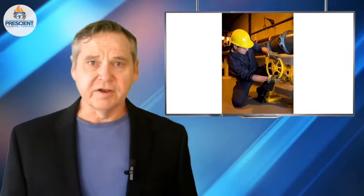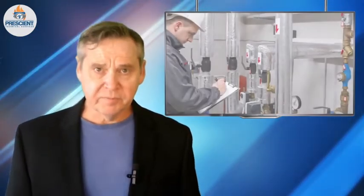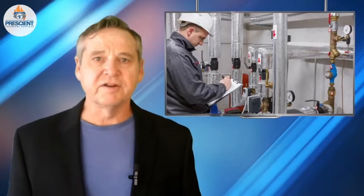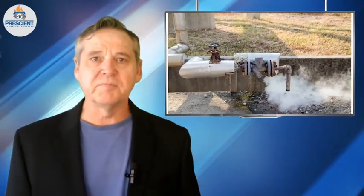The first thing I want to talk about is how to properly warm up steam lines, and it's all about opening and closing valves. Steam piping systems, when they're cold, can be deadly. All of the steam that first passes when you open that valve turns into water instantly. Some steam systems require a supervised startup, meaning individuals must be strategically placed at drains installed in the piping system so that water can be observed being removed, and those drains closed when they start to show live steam. That means we've heated up all the steel in the piping and free steam is now able to escape down a drain. This warm-up process could take hours, depending on pipe diameter, number of feet of pipe, where traps are installed, and other equipment in the system.